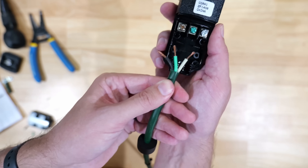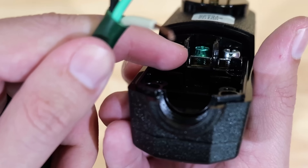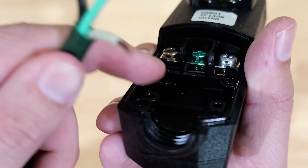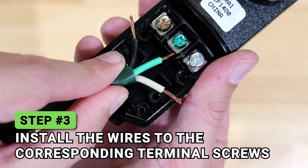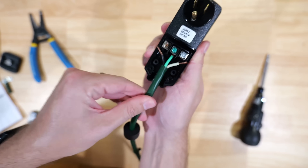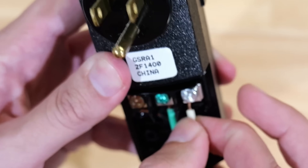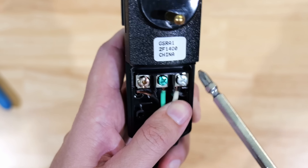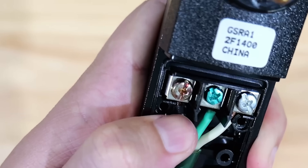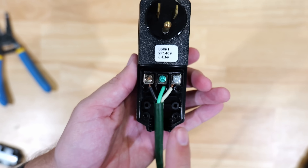Now take the cord with the wires and the new plug. I always like to start with the ground wire. Slide it up underneath the green ground screw — there is a plate that comes up like a vise as you tighten it down, holding the wire in place. Tighten it down and the ground wire is firmly in place. Next do the exact same thing with the white neutral wire under the silver colored terminal screw, then tighten it down. Finally, the black hot wire goes under the plate of the brass colored terminal screw — put it in place and tighten it down. All wires are now installed and connected.